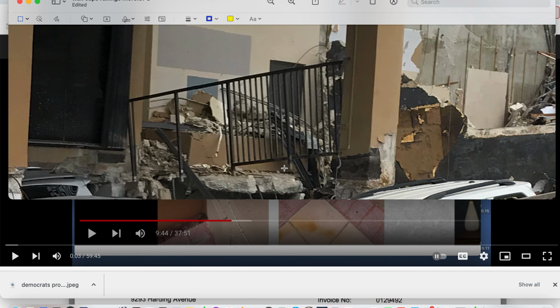And then there's a planter box. I think this is not just about even with the planter box. That detail. So the fracture is here. This is the one that we can see, right here. Remember, point here, but look here now. See this fracture in this planter box? This would be coming from the deck, not an impact from the top. Or we have a deflection in this end impacting, and it fractures, and this is holding on rigidly. But nevertheless, we have a rotation left, or we have a rotation right here, putting the fracture down here at the deck, and we're going up.